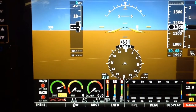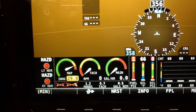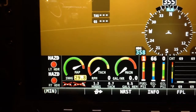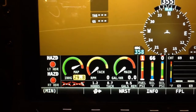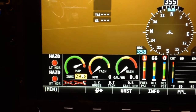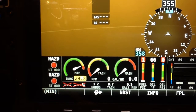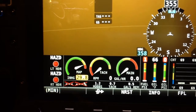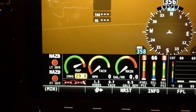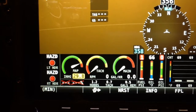The two in the lower left corner currently say 'hazard' and they are for the float switches in the tops of the two fuel header tanks. Those header tanks each hold a gallon of fuel, and as soon as the main tanks go empty and there's only a gallon left, those lights turn red and say 'hazard' instead of being green and saying 'full.' So that's kind of a very last-ditch warning — you've only got a few minutes of engine run time left.